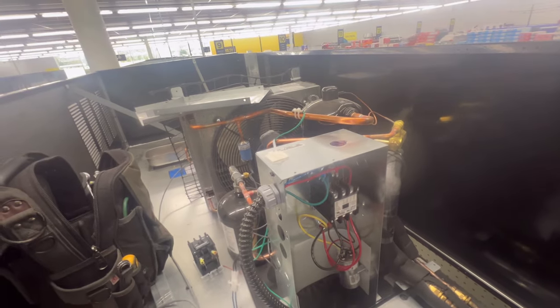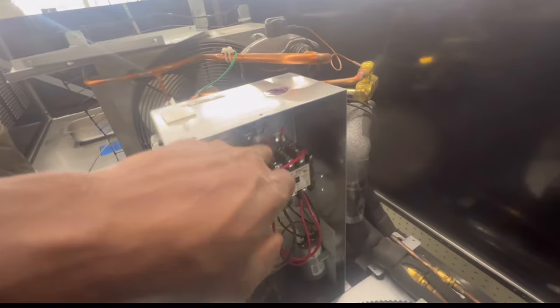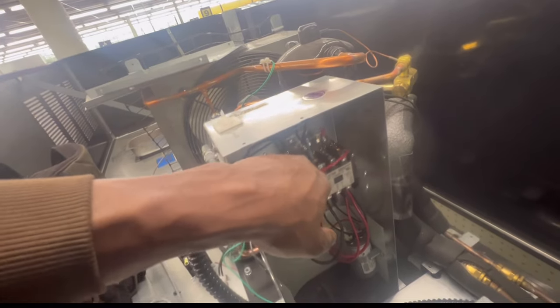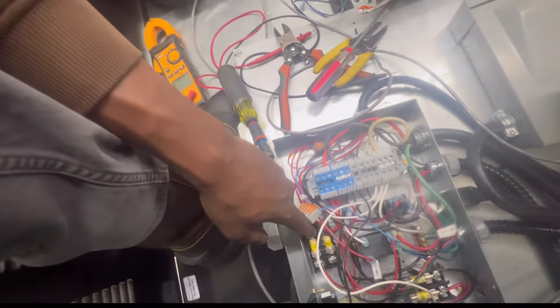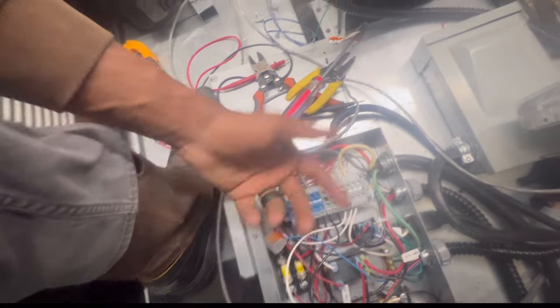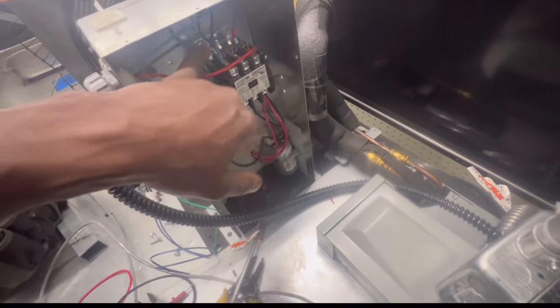This is where your main power comes in - these are the fuses, and I believe these are the fuses for the switch - I want to say for your heaters. I got to look at the wire diagram. Anyway, the wire diagram is right here if y'all want to look at that, take a picture of that. But that's what's under this box right here. I got my wire stripped like it's supposed to and I'll make sure these are super tight. You can flip this nameplate if you want to - just flip it around, or you can just leave it as it is, it ain't gonna hurt nothing. But just to be more technical - if you're OCD you might want to flip it around. Anyway, I'm finna turn it on in a bit. If you weren't getting power on that back leg, I would look at my fuses and make sure they're good. If my fuse is blown, I need to see why it's blown, whether it's from an electrical panel or from this disconnect box.